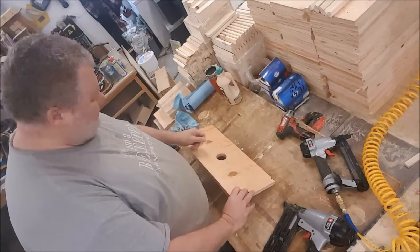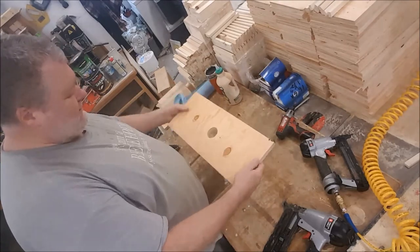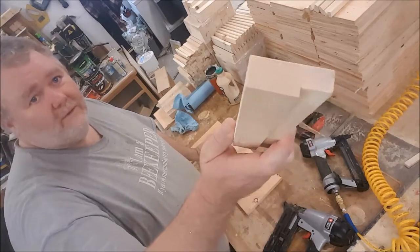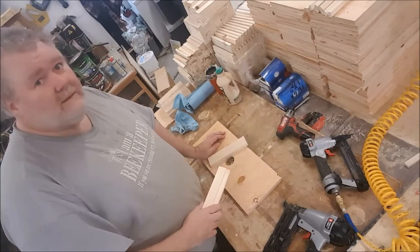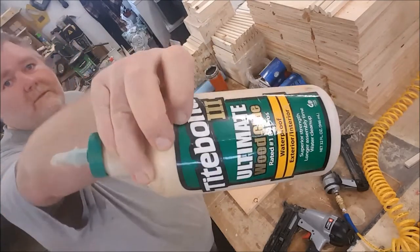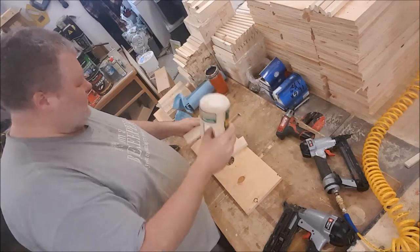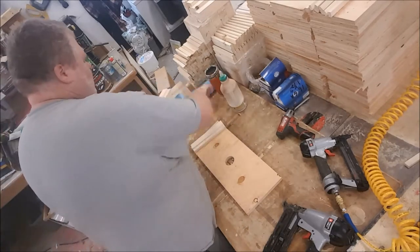For the five-frame cover, we start with three-quarter-inch plywood cut to size. You'll have to determine your dimensions — it's not very hard if you really think about it. I'm kind of fussy, so that side looks better to me than this side with a couple of knots. I start with the top of the cover facing down. These are my end cleats, milled with that little rabbet. I use Titebond III — it's waterproof since these are out in the elements, and it's also food safe for indirect food contact.